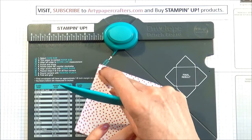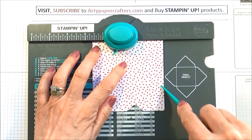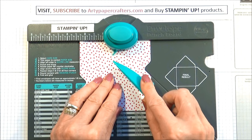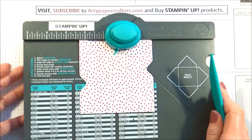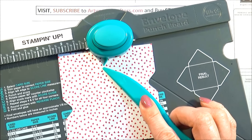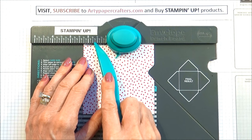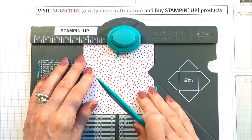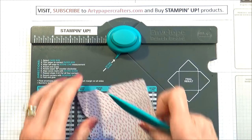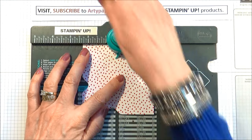Then move it round to the opposite side of where you've just punched, to one and five eighths, punch and score. Turn it round to the next side, 90 degrees, line it up on the punch board — and you'll notice that you need to line it up with this indicator arrow here. You'll find that when you line that up on the board, it does not line up at the one and five eighths, which is why I turn it 90 degrees, because then it works perfectly. Line this arrow up, punch and score down. Turn it round to the opposite side, which is a 180 degree turn, line that up again with your arrow marker, punch and score.